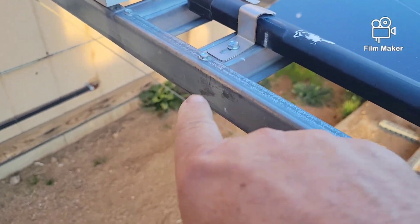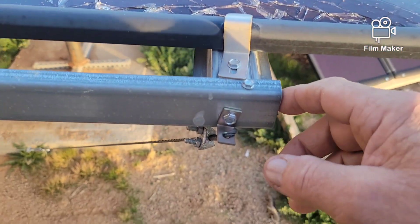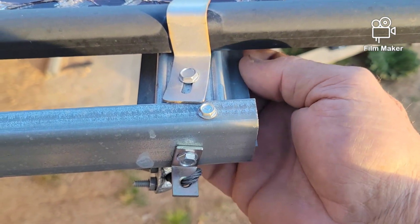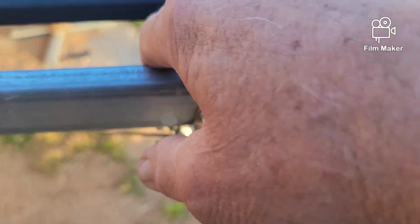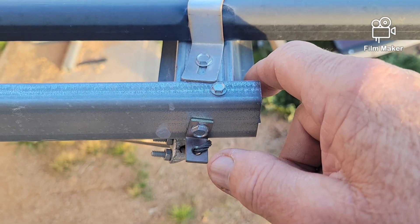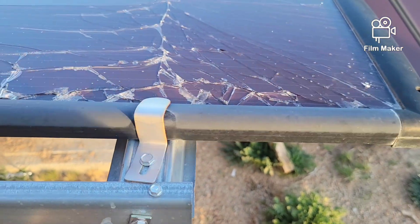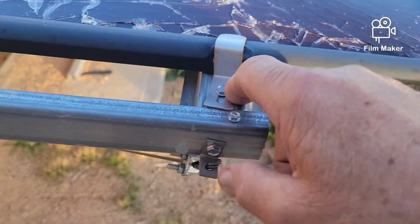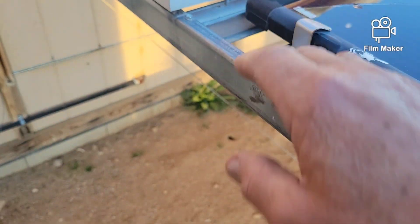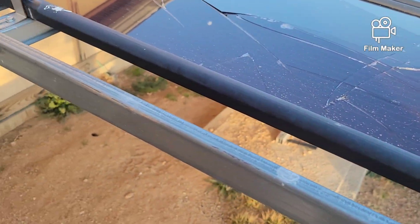They're a hat-shaped piece of metal — it's flat and then hollow up inside, coming up on the sides. When they build metal stud buildings, they'll strap these horizontally along the metal studs and then fasten the wall panels onto them, giving a little more strength and rigidity.